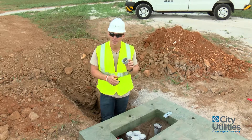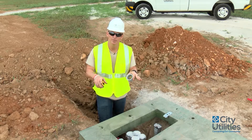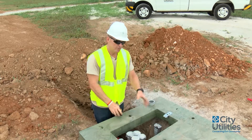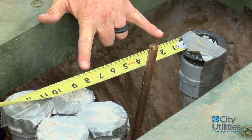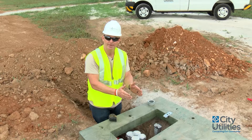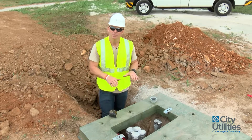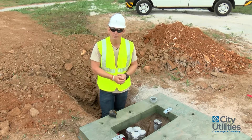The contractor has already installed bell fittings on the secondary side as well, because long secondary cable runs can also damage wire if pulled in without protection. On the secondary side — which is the right side of the transformer — the lid opens this direction and the bulk of the tank sits in the back. We like to have at least a minimum of eight inches of separation between the primary and secondary areas, with the ground rod installed just to the left or right of that window. He'll need to do a little height adjustment, but once the gravel is in, the pad will be perfectly level.